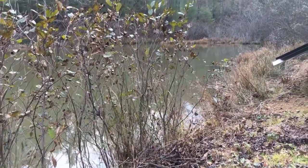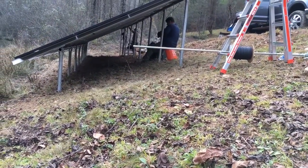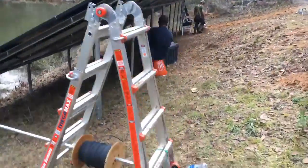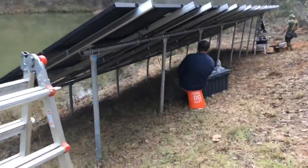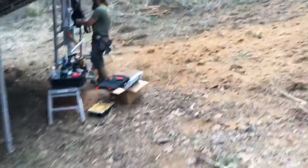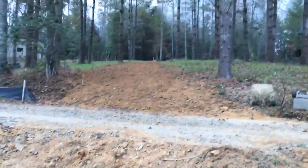She's right on the side of the hill and right on the lake. The lake is not usually this high — they lowered the lake, something's going on with it right now. They wanted it just as close to the lake as possible because the house is kind of in the way. We also used Trina black modules — all-black with black back sheets. This was a tough one. We trenched over 250 feet and she's going to have very little voltage drop.